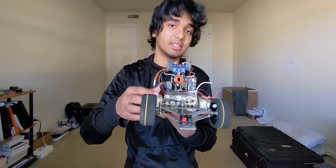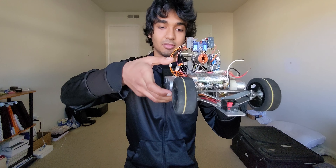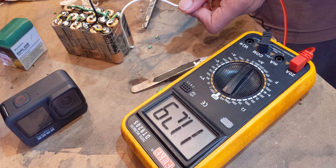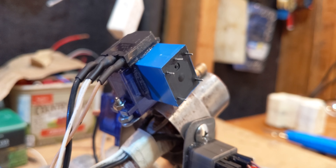The tolerance where the battery goes in was really tight, so I had to bend and squish it in — which was a bad idea, because some leads from the capacitors poked through the batteries, causing liquid to come out, it got really hot, and it basically died. So I had to make a third battery pack using normal batteries. It has two more cells, is a bit heavier, and doesn't deliver nearly as much current. With that sorted, the next thing was to make the trigger and the charging switch. I was thinking about using a relay for the charging switch but that idea would have led me to buy new components, so I didn't do it.